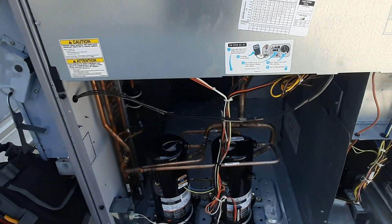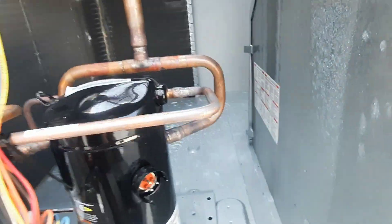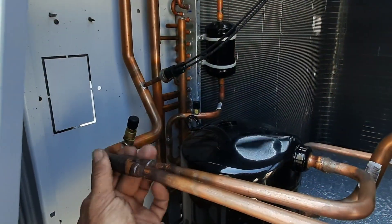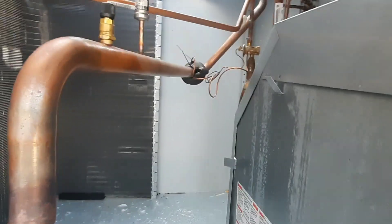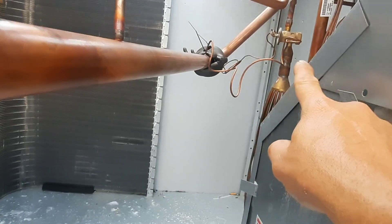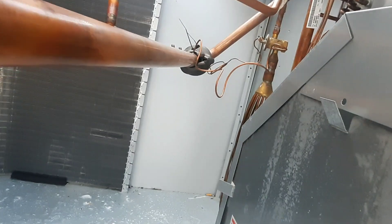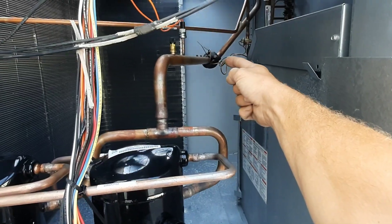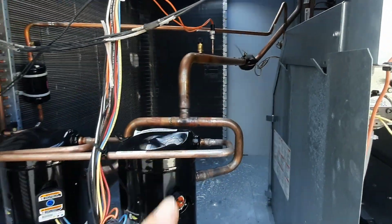Stupid economizers - not a Jade, these are pieces of junk honestly. It's a Carrier, so I'm going to bet I've got a cap tube rubbing somewhere. Carrier's always got a cap tube rubbing. It'll be secured back there, rubbing on itself just being pulled up like that - usually it's right here, or it's just almost touching the suction line, unless somebody pulled it off.